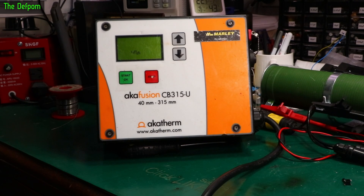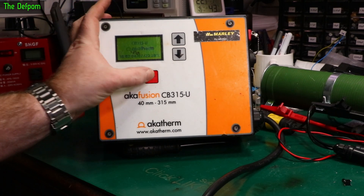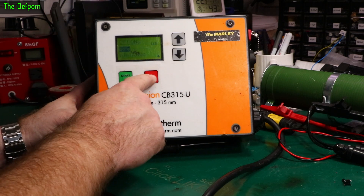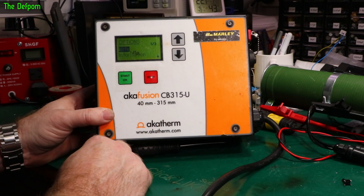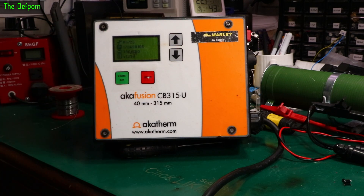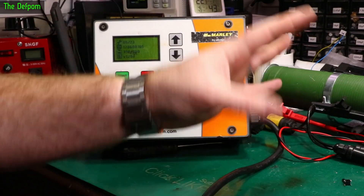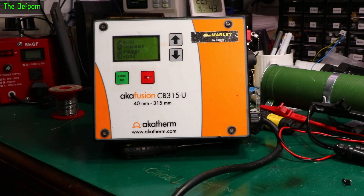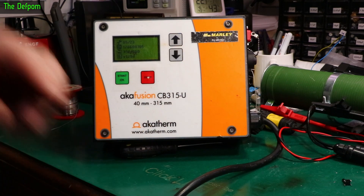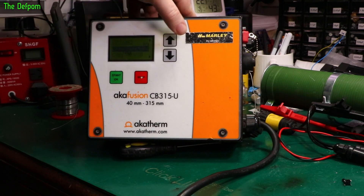Let's clean it again, then I'll put it back together. Let's plug the power back in. Maintenance alarm — that's fine, I'll know about that. Look at the button — the button worked! It beeps now too, and now we can get into the menu system and look at things. Maintenance was due two months ago, so that needs resetting. I've already tested it — my test jig is over here. Verified the output is correct, checked the cables, safety, resistances, earth leakage, insulation resistance. I've done all that testing already. At least now we can get into the menu system and reset the alarms.